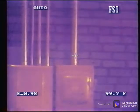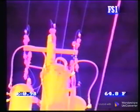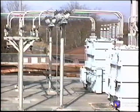Solar reflections are just that, reflection of the sun or atmosphere. A reflective surface, or one of a low emissivity value, will cause you to actually measure the sun or whatever it is reflecting. At night, the reflective surface will appear much colder since it is reflecting the cold atmosphere. When you are scanning during daylight or dark, if you can visibly see a bright spot or reflection, then the same shape will be in the thermal image. In the sunlight, it may be difficult to determine whether the spot is a reflection. The reflective temperature could mask an anomaly. For this reason, most outdoor scanning is performed at night.